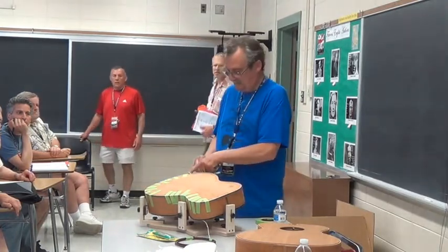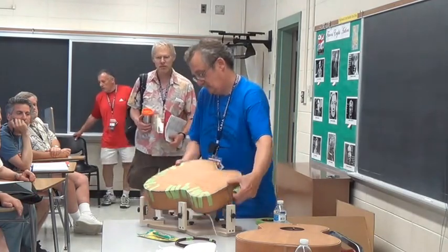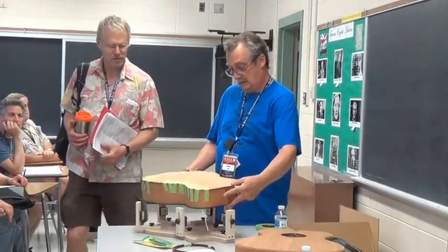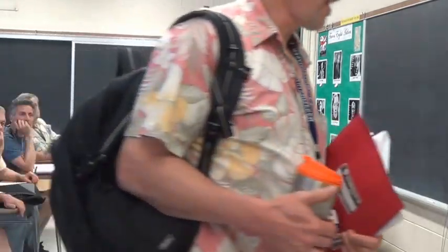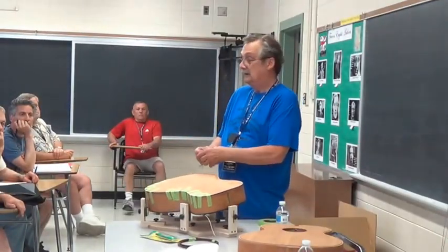Okay, and if you notice, some of the grain is coming up. Oh, wonderful. Okay, that is what you want to try to do to avoid that: pull your tape across the grain like that, and that will help you eliminate that problem.